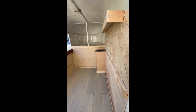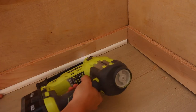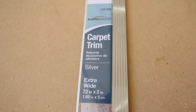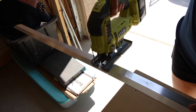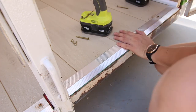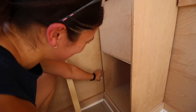We've got an accent wall, a display shelf, an ice holder, and trim. Now we just need to fill in those huge gaps, and I did it with shoe molding — pre-primed pine that bends and maneuvers wherever you need it. I used a piece of carpet trim to conceal where the floor starts right when you walk into the trailer; it cut easily with my jigsaw and a metal-cutting blade. I attached it with wood screws drilling down into the 2x6 boards at the base of the horse trailer. I also ripped ¼-inch plywood into about one-inch-wide strips to attach to all of the exposed edges of plywood.